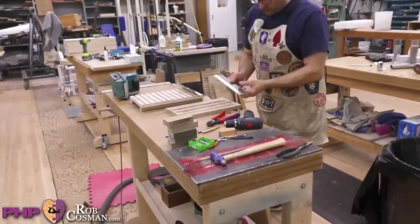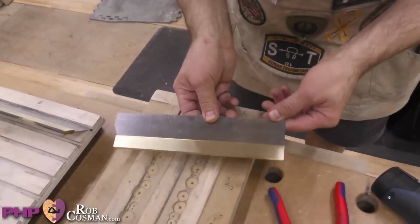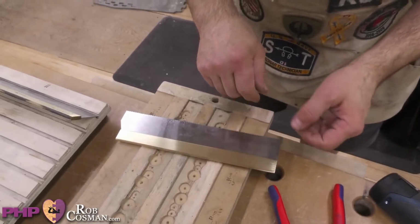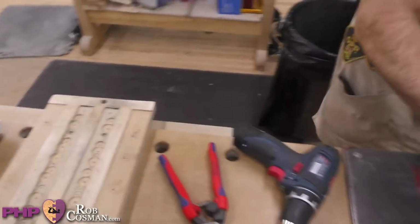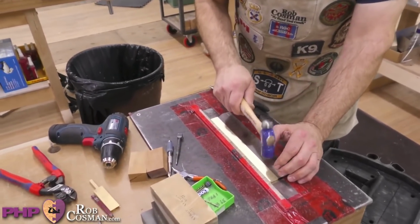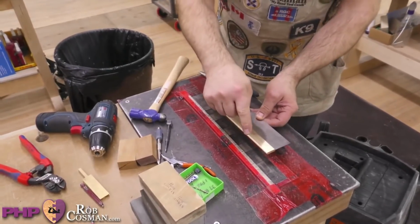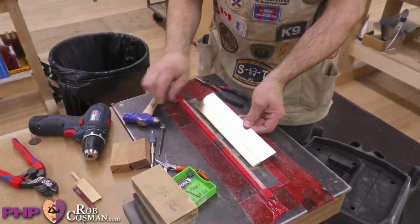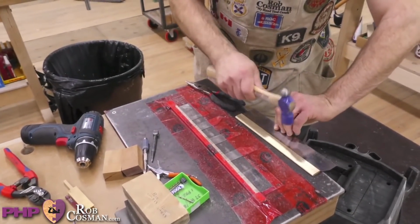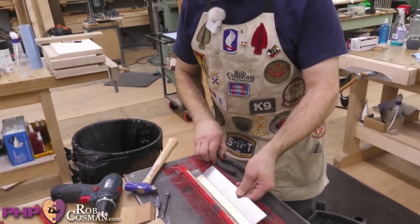And the latest thing he did for this: when Ken and Ian make our saws, we drill 4 holes and we put in 4 copper pins. Then we have to flare either side of the hole. We used to do it right here. We sit there like this, and we put in a little copper pin, tap, tap, tap. These little pieces of scraper blade allow just enough excess copper in the bottom side that after you flared this one, you'd flip it over and finish tapping it. Well, when you're teaching somebody new, they end up hitting the brass, and there's moose tracks all over it.